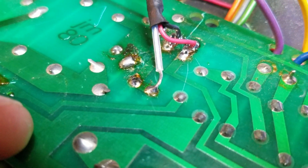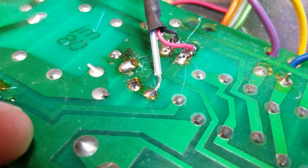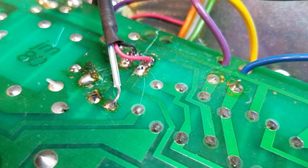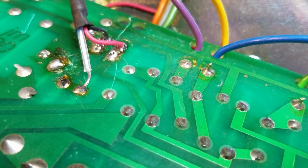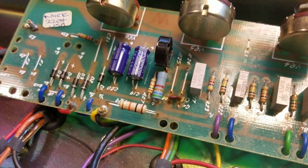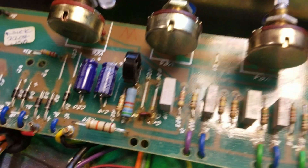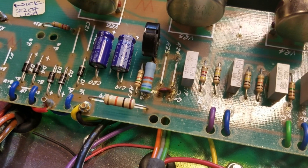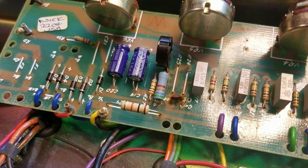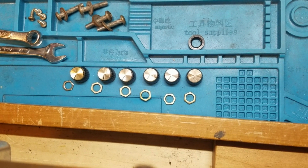You can see where I've attached the shielded wire leads to the bias supply where the bias splitter resistors were previously, along with the signal leads. You may be wondering why all the other wire leads are soldered from the top side to the bottom, but I did it the opposite way. The reason is: if somebody decides to revert this back to a non-master-volume amp, they're going to need to remove this PCB to do it correctly, which essentially ensures they remove the master volume wire lead the right way.